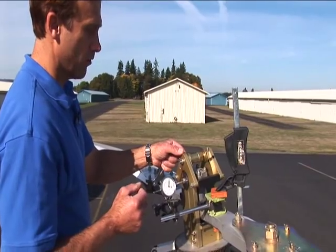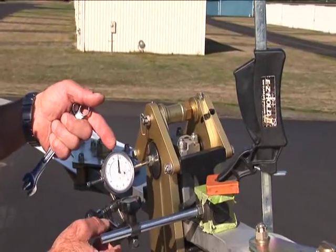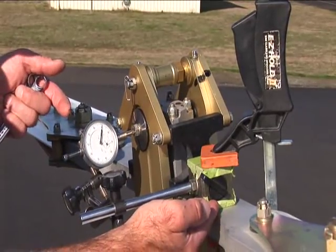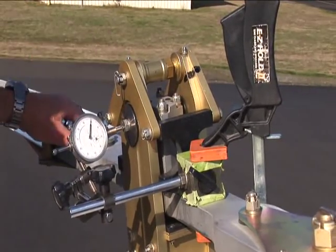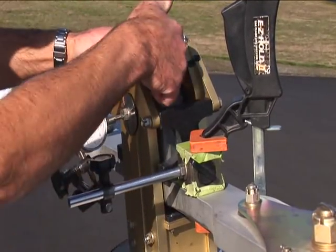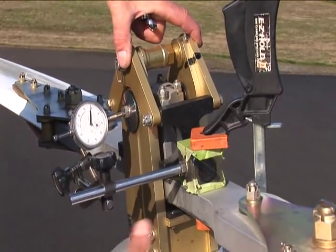You can see one blade is high and one is low — a little darker in the day you can see it better. With the dial indicator on here it goes to the center, and you can pick this up at any tool store — a dial indicator and a mag base. Clamp it on the hub bar; the blades can teeter freely because we're on the center of the teeter bolt or just off to one side. When you make an adjustment, the blade rotates — tighten this side, loosen this side, that's going to draw this up. The block stays with the towers and the blade is rotating.